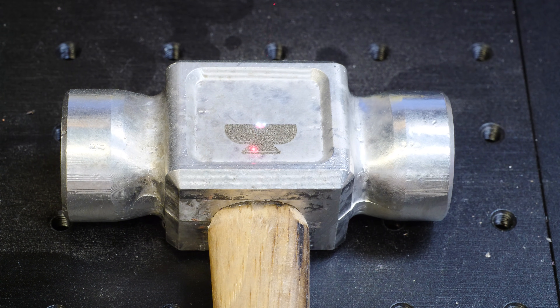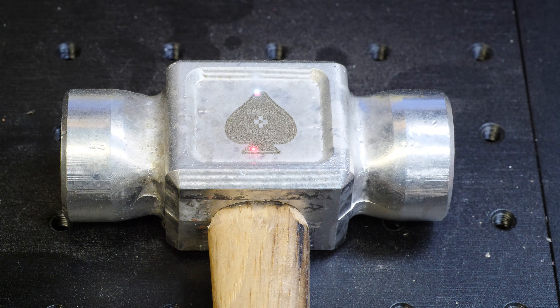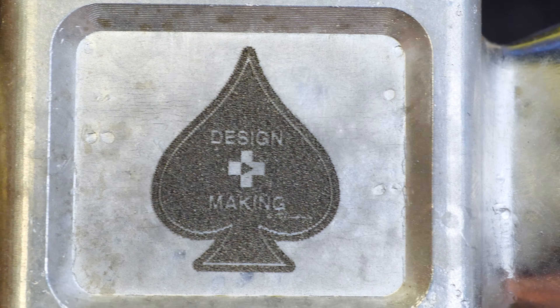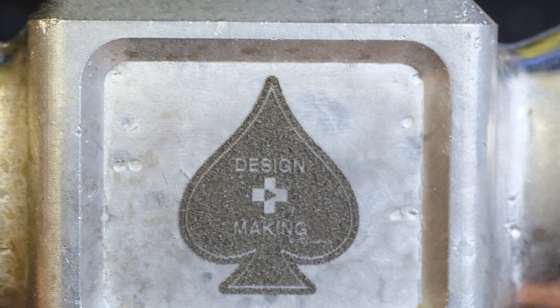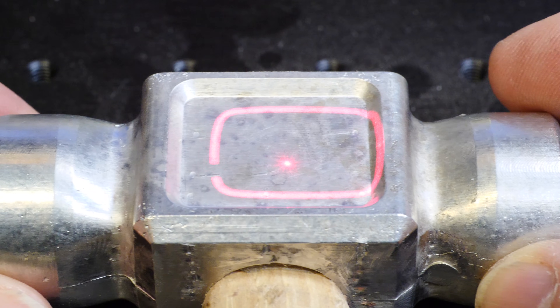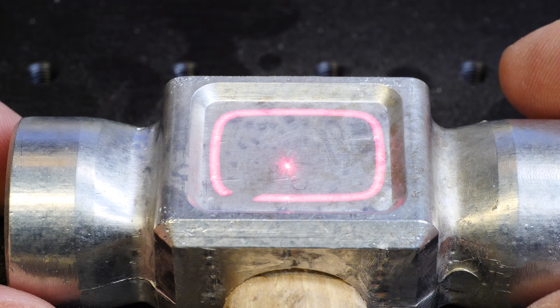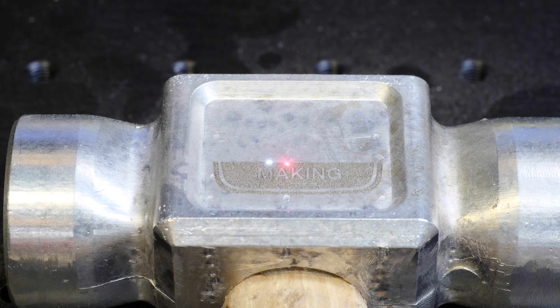It easily lasers this piece of tin bismuth — we've tried it on several other pieces of metal and the results are consistent, predictable, very repeatable, and give a really nice finish. The tin bismuth is pretty soft and leaves a little texture which is actually kind of nice and very readable. I highly recommend it — I'll leave a link below. Using LightBurn with it has really made etching metal much easier and more enjoyable compared to the unit we had before. I'm very positive about this machine so far and it's really nice to have in the shop.